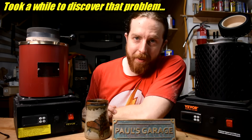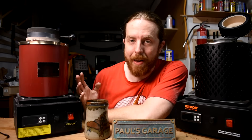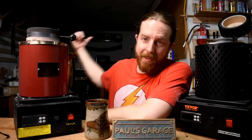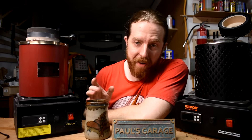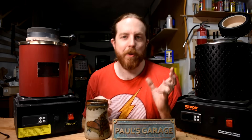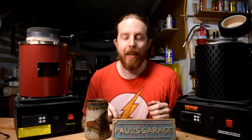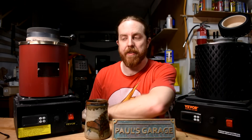Turns out there are a lot of reasons why. Reason number one: overuse. These things have a use life on them. Anything at bronze temperature is really expendable — that goes for furnaces, those big honking crucibles, heating elements in kilns. Everything is expendable at 2,000 degrees Fahrenheit. And heat is bad enough, but I've read that these graphite crucibles — the carbon in them — actually reacts with the oxygen in the air when it's that hot and creates a reducing atmosphere inside the crucible. It seems like they're eroding away as they're being used.